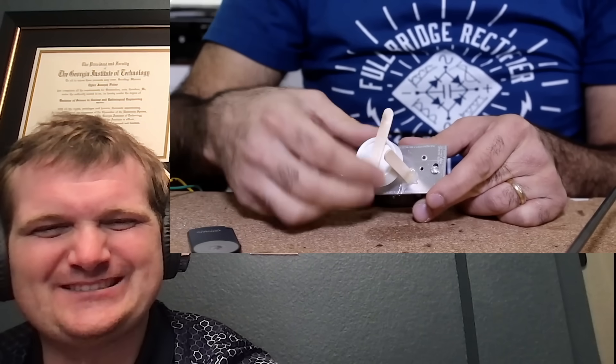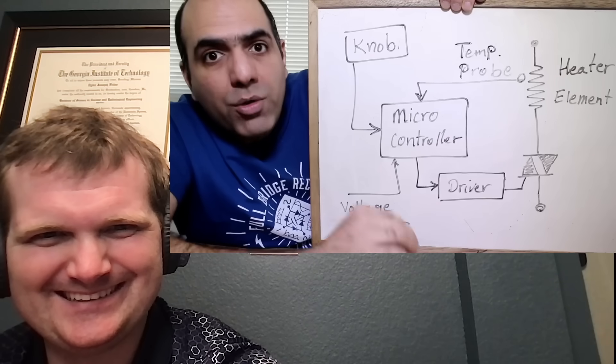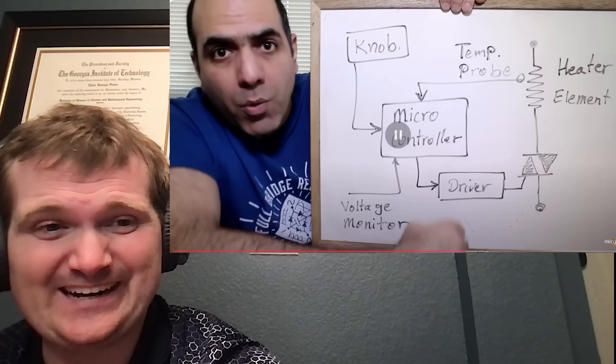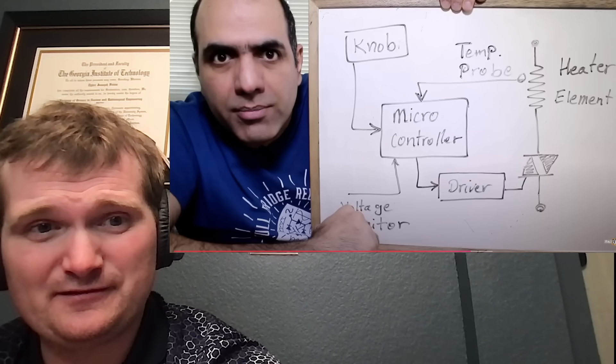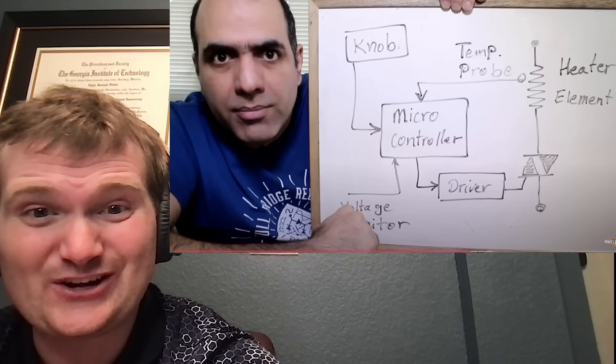His solution: hot glue two pieces of stick to limit how far you can turn the knob - we don't need more than half anyway. That's a simple solution, though if somebody accidentally breaks those sticks and sets it to maximum, it could overheat the heater or the dimmer and set the house on fire. We could design a very good system where a microcontroller monitors the heating element's temperature and PWMs the output power - kind of like a thermostat controlling temperature to exactly what you adjust, using a sophisticated and fail-safe control algorithm. Have your control algorithm, and if it fails, have it fail safe by turning the heater off. Good principle.